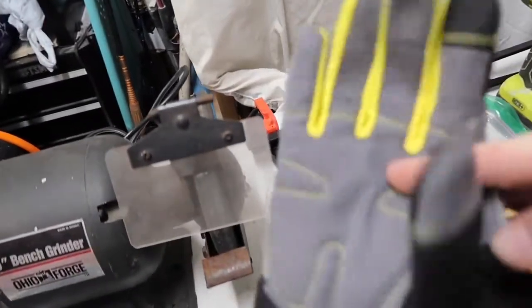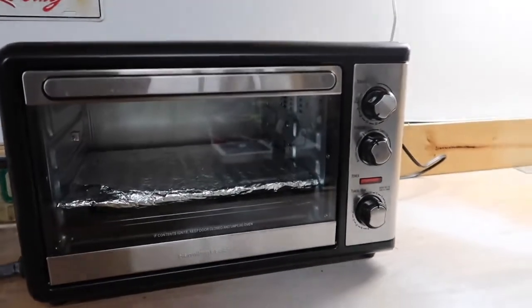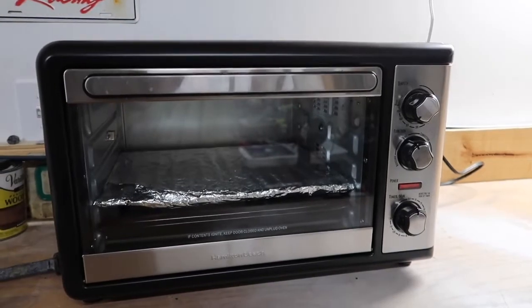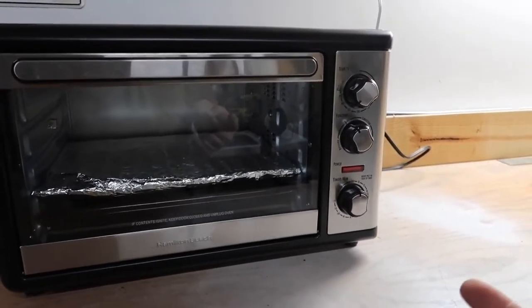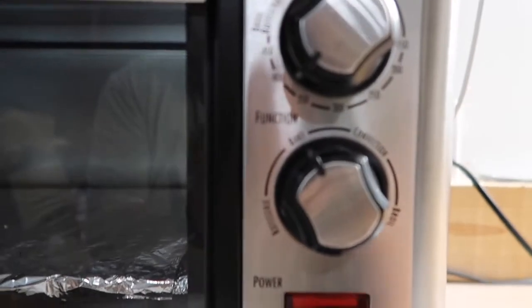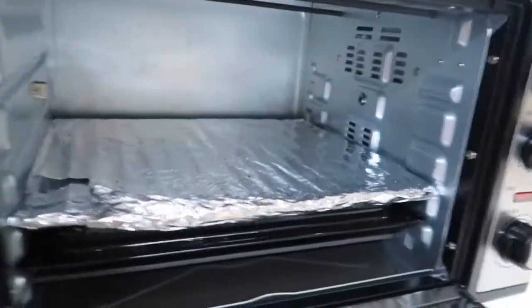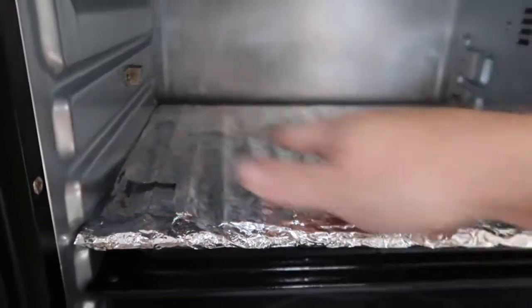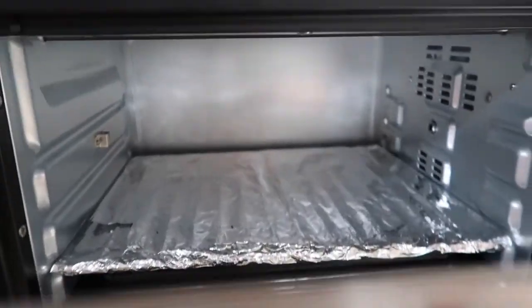You'll definitely want a good pair of gloves because when you are pulling the Kydex out of the oven it's really hot. For the oven, I have this little tabletop oven. I used to use the oven inside the house but got tired of the Kydex smell filling the kitchen. I found this one on clearance at Walmart for 30 bucks — it works great, it's got convection and bake. I set my temperature to about 375 and let it preheat. I also wrapped my tray with foil so the Kydex doesn't droop and I don't get a bunch of lines in there.